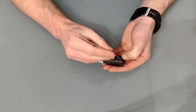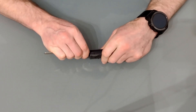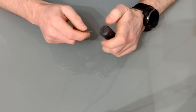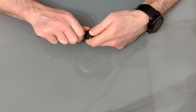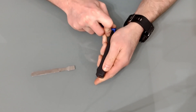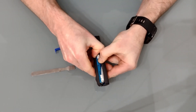Next up we need to get into the casing of the battery itself. The easiest way is to go for the raised bit of plastic on the outside edge on both sides. I can just get my nail under this edge — you can see it's just starting to move as I lever it. Do the same at the other end. Once you've got the edge open, just pop a plastic tip in and run down the edge — and there we have it.